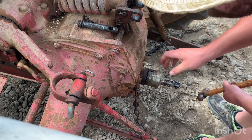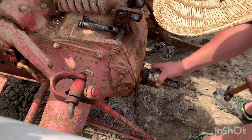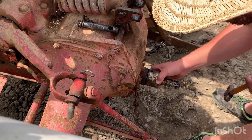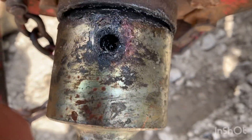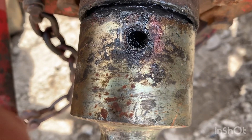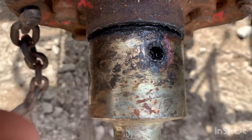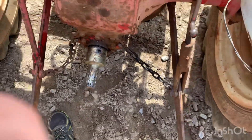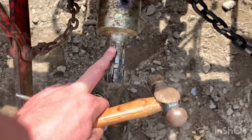You've got to be careful - you don't want to get it in too far because then on the opposite side it will come right through. You just want to get it in just far enough where the other side is about flush with the metal on the inside. It's really hard to see down in there, but you don't want it too deep or not far enough. Whenever you feel it's spinning, it's in far enough, but check the other side - some roll pins I've used are a sixteenth of an inch shorter, so you want to make sure it's kind of centered. Then all you do is put your grease fittings back on, pump some grease in there, and you're good to go. It's always a good idea to put a little grease on your shaft too.